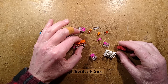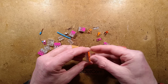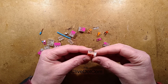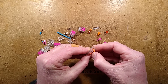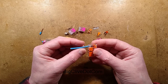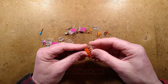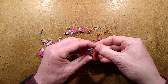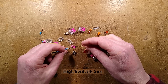Although I've featured WAGO connectors in the past, I've never actually made a video where I took a connector itself apart. Let me demonstrate a WAGO connector. This is a commoning connector — a five-way commoning connector. You lift the little lid up at that terminal position, you stick a wire in, you close it, and the wire is now connected. If you add more wires, they'll just be commoned along. If you want to get it back out again, you lift it up and you remove the wire. It's very, very good.